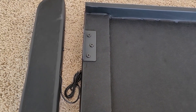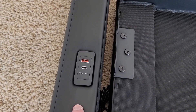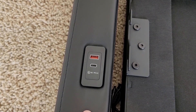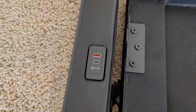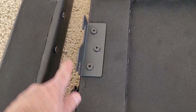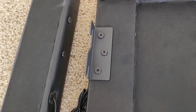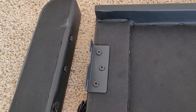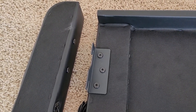Now let's go ahead and add our side post to our headboard. I can't tell you how pleasantly surprised I am to see this charger on both sides — it has USB and USB-C. I'll never have to search the house for my charger ever again. For this part, we'll have to loosen up these bolts right here just a fraction, slide them into the bracket, add one bolt right here, and then tighten it down slightly. I like to wait to cinch all of these bolts down until the whole frame is put together, just to make sure it's square.